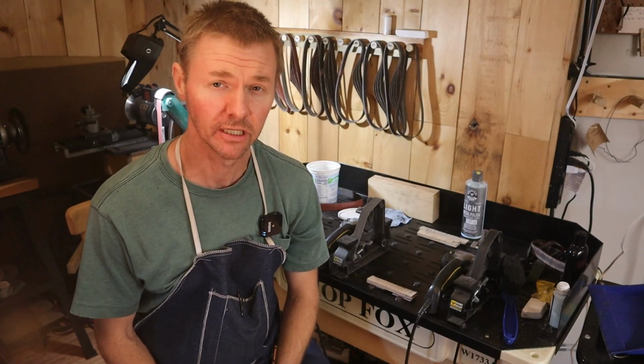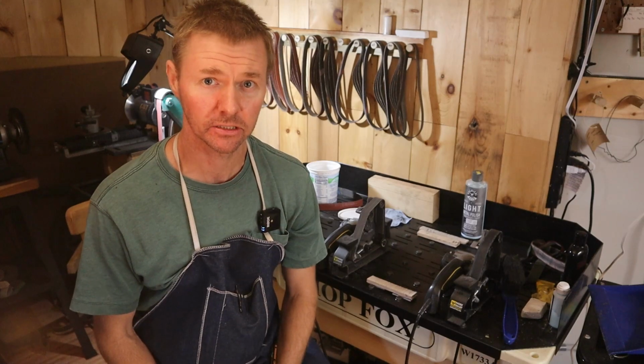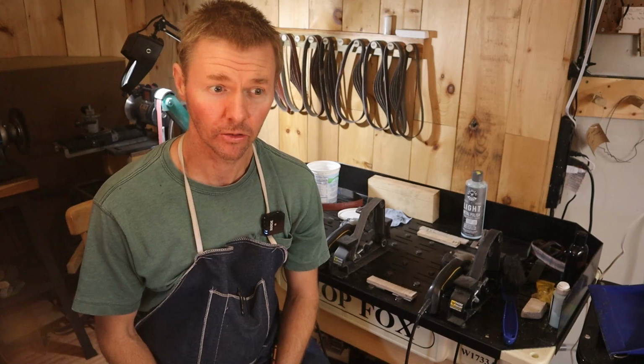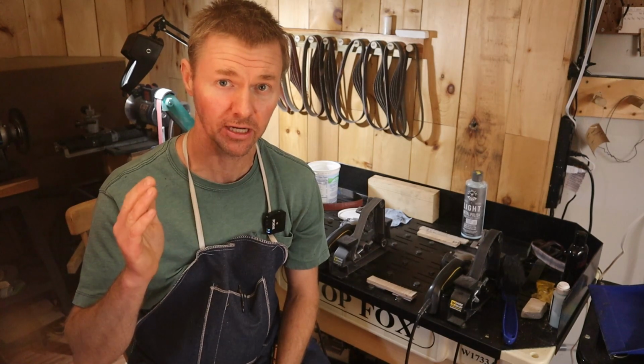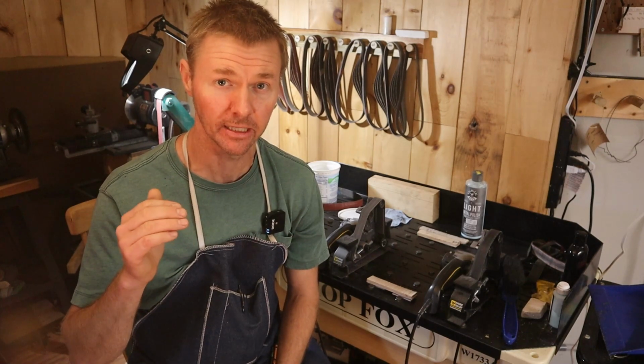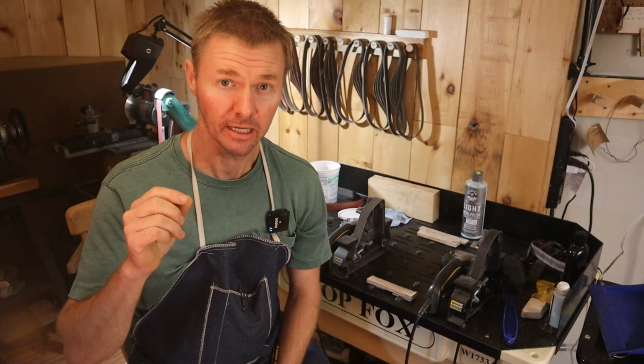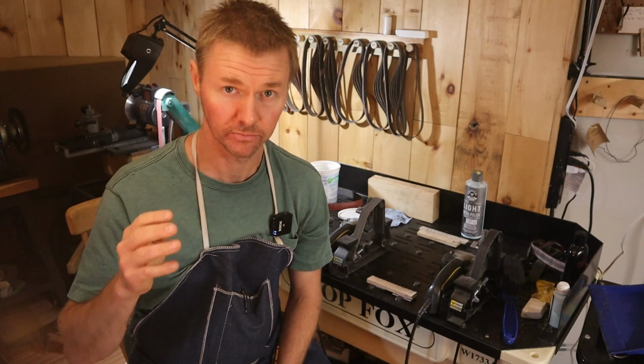that this tool solves is that during the sharpening process, the first thing you must do is put up a burr. And then the step after that is to refine the edges. And what can happen there is the burr ends up going back and forth. And as you refine your grit that you're sharpening at, the burr gets kind of thin and flaky. And sometimes it's just nice to be able to remove it in a way that isn't going to be problematic.